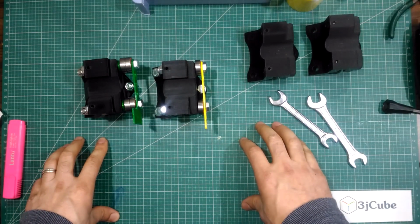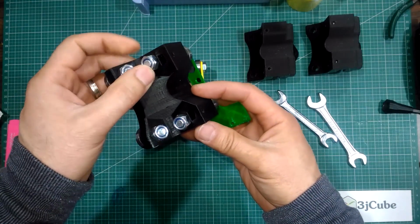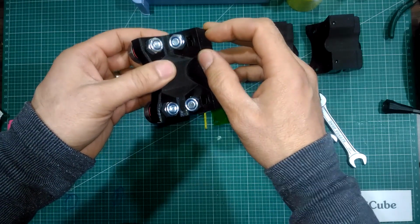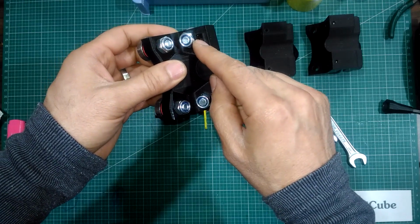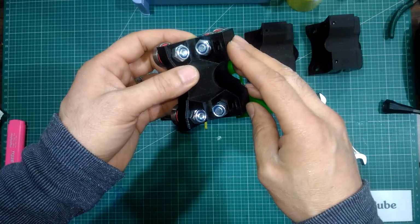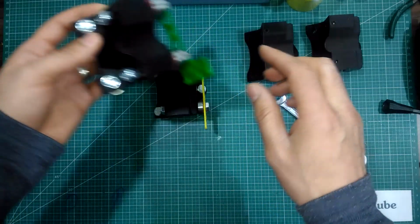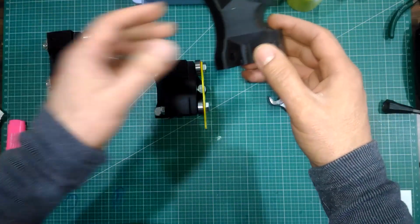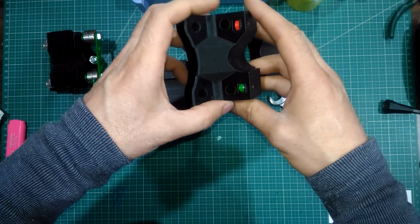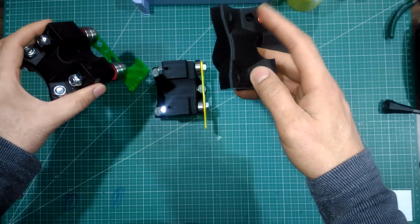I want to mention 2 points here. Be aware that the M8 nuts are not closing the pocket holes designed for the M4 nuts that will be used later to assemble the roller mount piece. Otherwise, if the M8 nuts are closing it, put the M4 nuts in from now, to avoid reassembling the roller because it will be closed later.